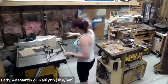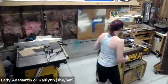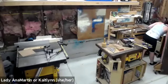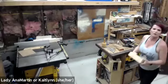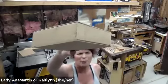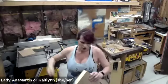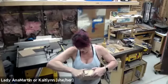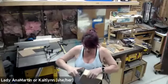I'm going to show you a trick on the miter joint. All right. So let's see if I've got a burnisher here. Sure I do. This will work. You can all see that there's a gap in that joint where the two pieces come together. And take a burnisher, which is any hard round thing. Rub the edge of the joint, assuming that I had set my nails.